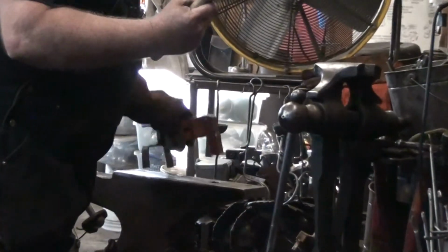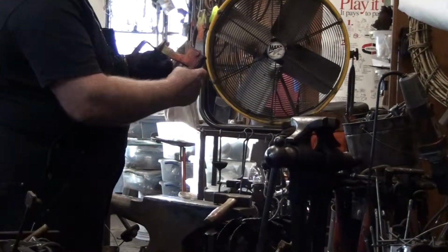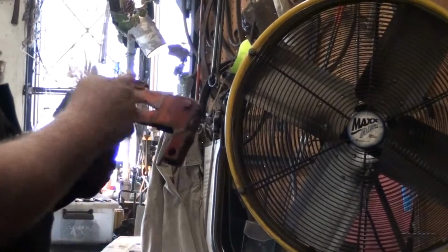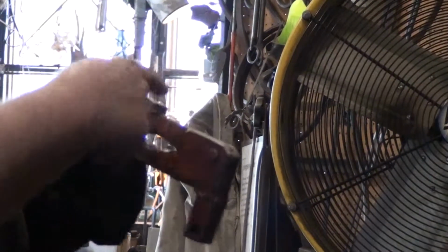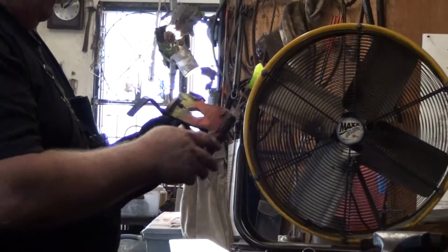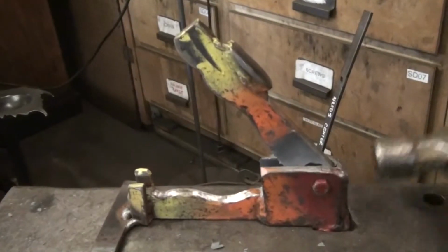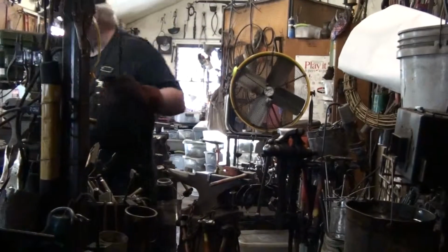And I'll pick up the size of my hammer a little bit, about a 2.5 pound hammer. And this is what I call a gate handle. It opens and closes, swinging like a gate. Some people still call that a guillotine fuller. To me, the guillotine comes down parallel, straight up and down, and this is a different designation, different mechanism of action. All right, torch heat.